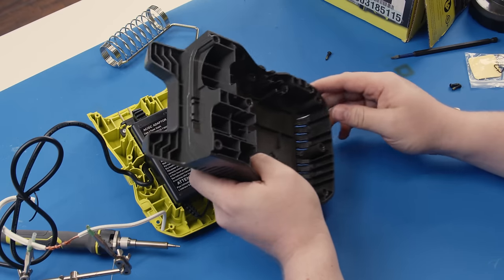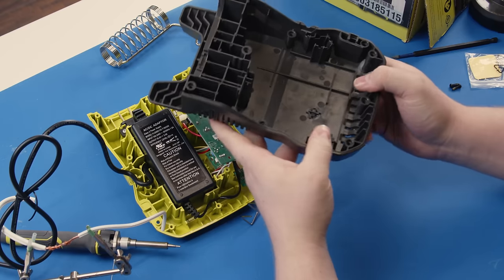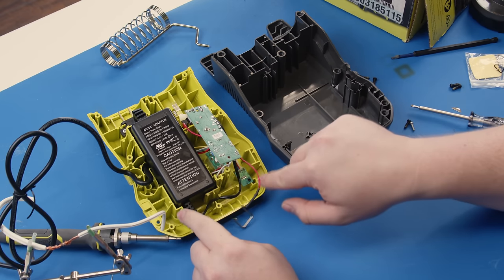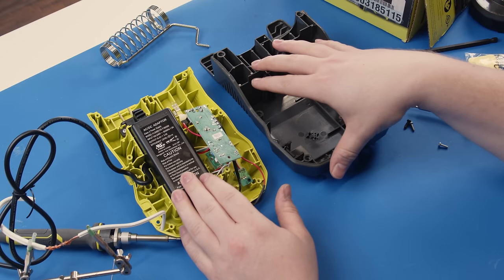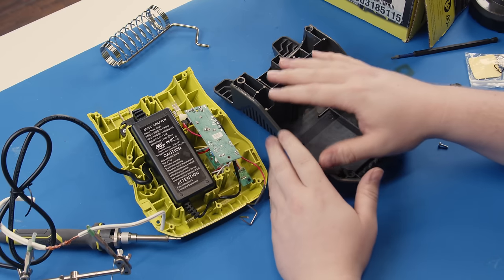The only exception is right up here in the bottom, you've got these tiny cooling slots at the very bottom of the thing, but you really want cooling slots to be at the top for obvious reasons. Any heat coming off these diodes, for instance, I don't know if it's going to make its way over there. It seems like you could get a lot of hot air built up inside this thing that wouldn't go anywhere. And that kind of feels like the final contradiction here. This thing is just 50-50.